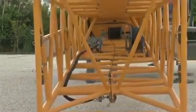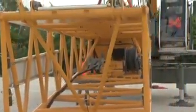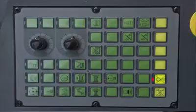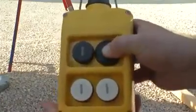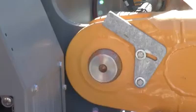The pins are controlled via the assembly remote control delivered with the machine and connected to the upper carriage. First of all, switch off the machine and plug in the control unit. Then restart the machine and select cylinder functions. Now the remote control can be operated. Secure the boom foot with pins and pin locks. Before removing the remote control, please switch off the machine again.